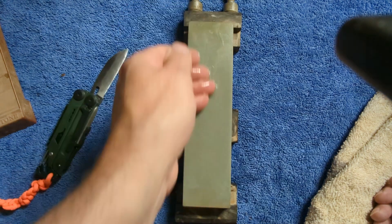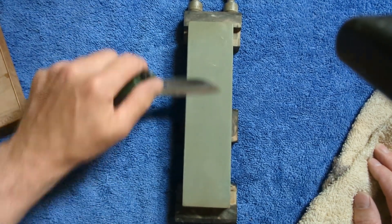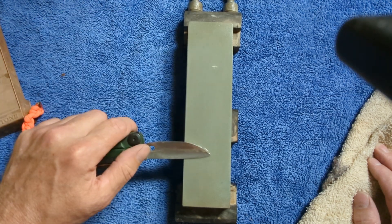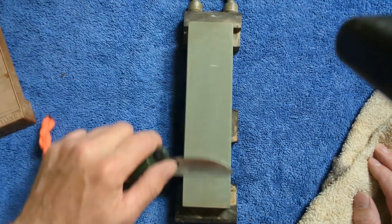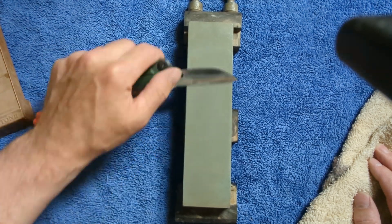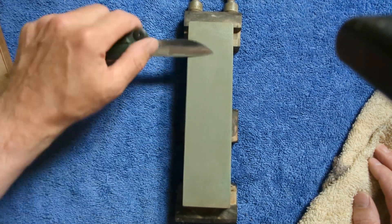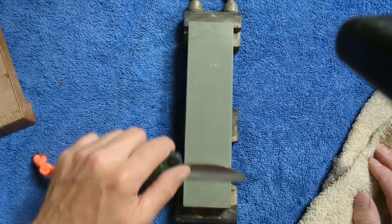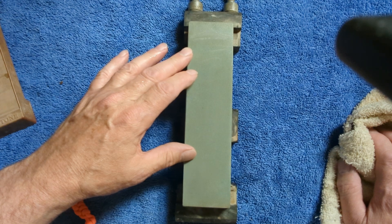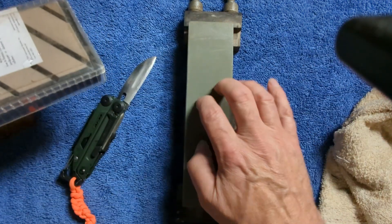You need a little more water on the stone — as you go with these, you have to keep adding a little more. There's just something relaxing about using water stones. These are more for simple steels. You don't want to use these on super steels. You wouldn't want to sharpen S90V, K390. I think even something like MagnaCut would be pushing the limits of these stones. I have used 3V on these stones before, and by the time you do a re-profile and get what you want, you have a little dish in the stone. And once you start to get too much of a dish, this flattening stone can flatten your water stones.